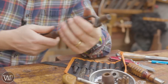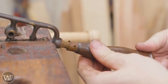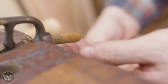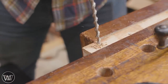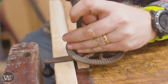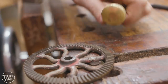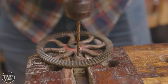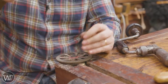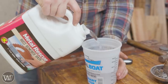The handle is actually threaded onto the main body, and this one was on there really really well — it was well corroded into place. I had to do a good bit of twisting, actually putting it in the vise to turn it off. But eventually we got that turned off. Now I'm actually going to make a little jig to hold the casting so I can pound out that rivet. Whenever pounding on casting you want to make sure the casting is fully supported, so I'm pounding on the rivet, not putting weight into something that is breakable.